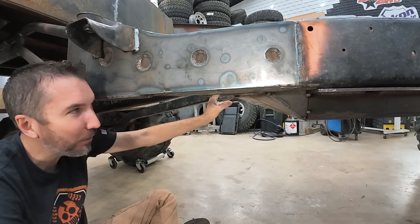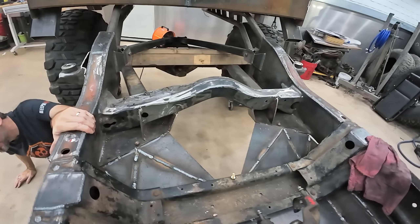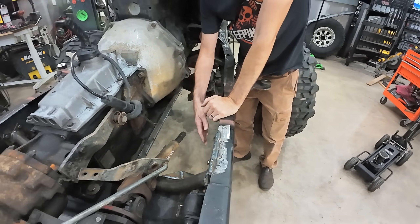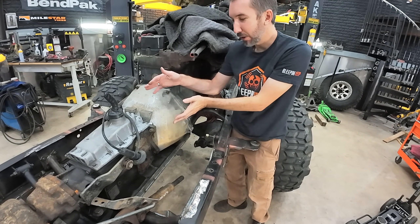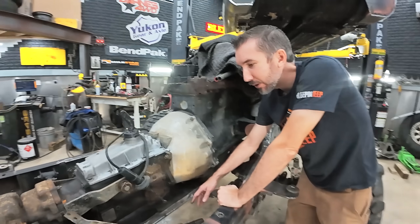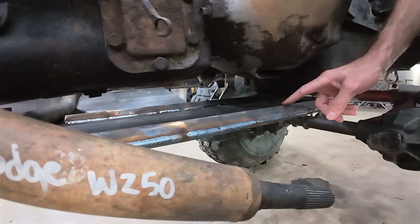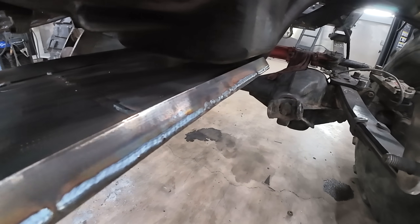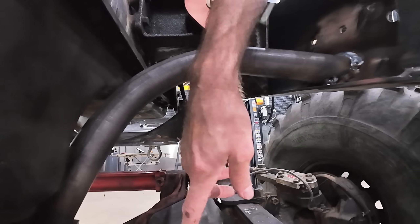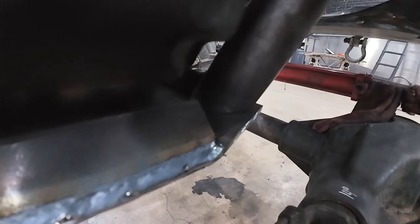One of the things we also had to figure out was the drive shaft. The drive shaft has to come through here on the rear — pretty self-explanatory. But on the front it's a little bit different. The drive shaft has to come right through here, so you can't really have much of a skid plate on this side. But you can push that skid plate over to the passenger side, so we did that a little bit. And this thing has to come all the way up and protect the oil pan — that's hard to do unless you make a monstrosity of a skid plate, which is what we did. But then you don't want it to bend, so we put this angle iron into it to keep it from flexing. When you come all the way up here you have to mount it to something, so we put these tubes in here and mounted it sturdy to those tubes. But you have to watch out for the drive shaft because it's going to come up when it flexes and you want to make sure you've got enough clearance right there.